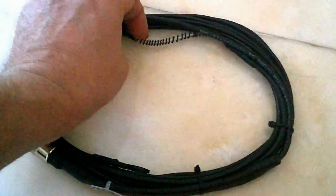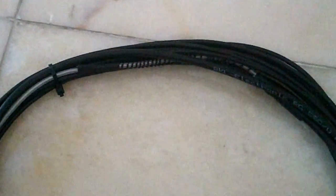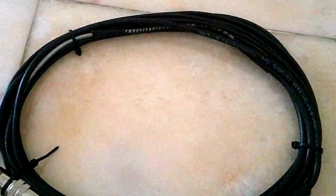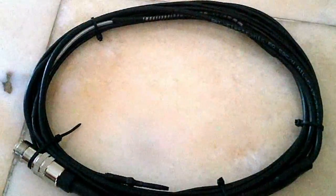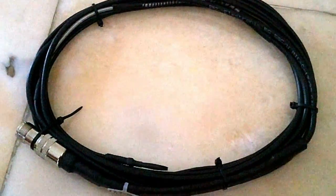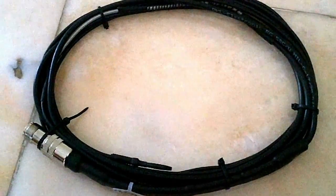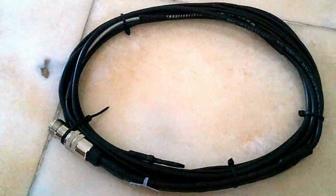You'll see there's an adjuster here which you can move in and out to adjust the SWR, and it's not the normal one which is on his website, because that is for German channels, 26.5 to 27.4. So it will not cover the UK40, so don't be under any misapprehension — the original version of the antenna doesn't do the UK40.